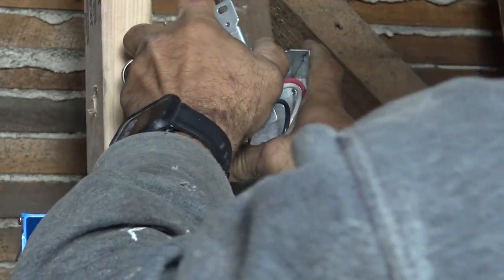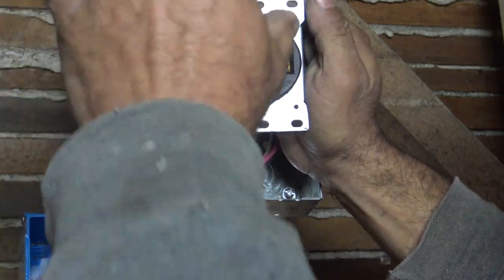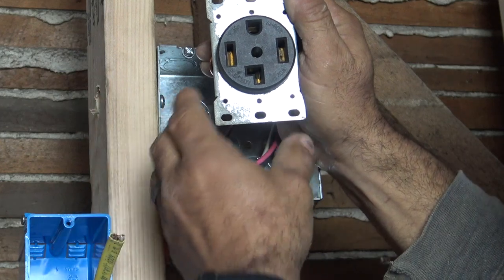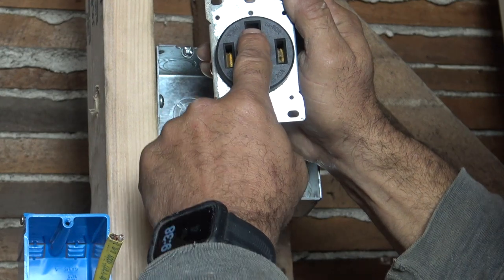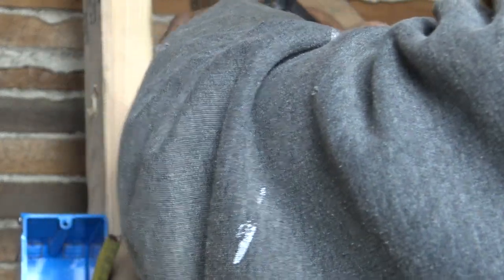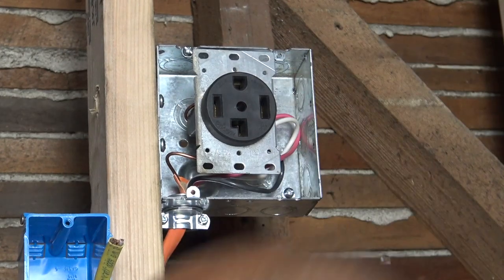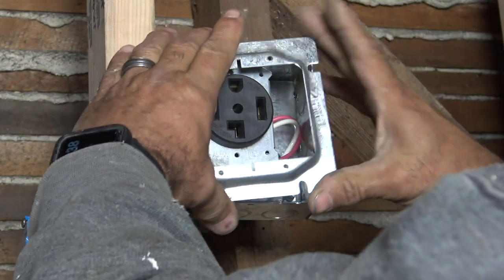Quite a good tip for you when you're doing this. The plug that you're going to be plugging in, going to go right here. The ground is on top of that plug, the whole plug is usually molded, and the wire is coming on the bottom. So try to keep the ground on top, so when you go to put everything together, you don't have this wire hanging out like that, looking like a noose. And you see, I'm bending everything, bending it over.